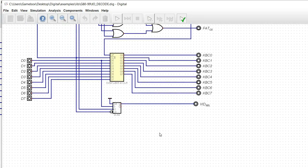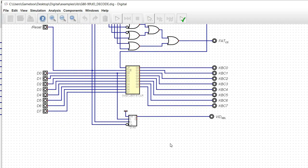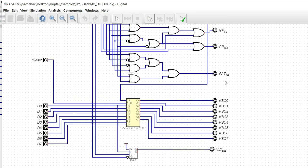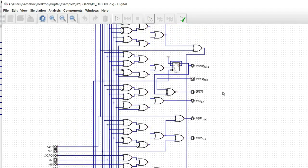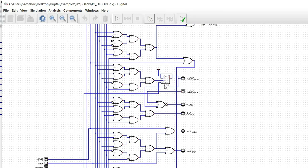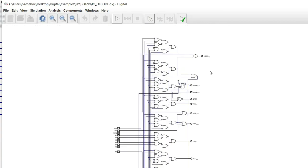As you can tell, we can go in here and this is just an octal latch with a clear. We have a flip-flop register with set and reset, our basic IO decoding, and a flip-flop. We could simulate all this if we wanted to, but there's no point at the moment.